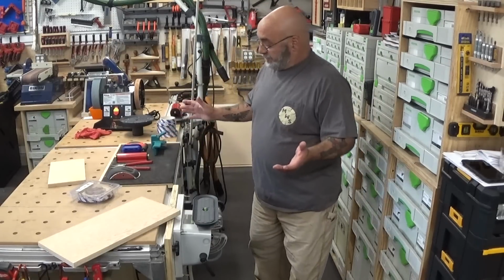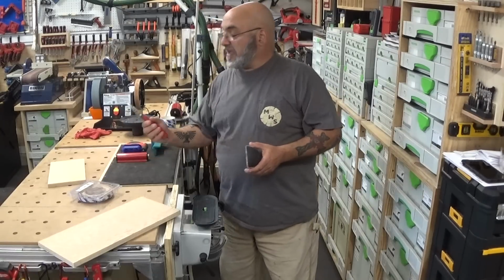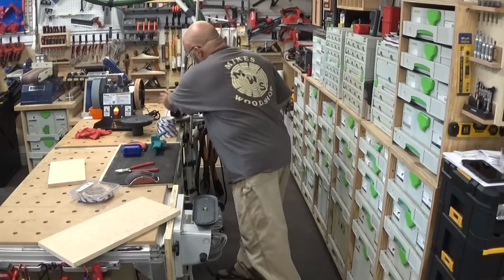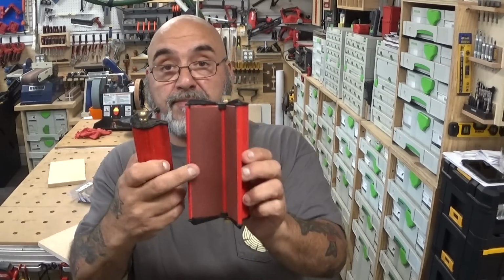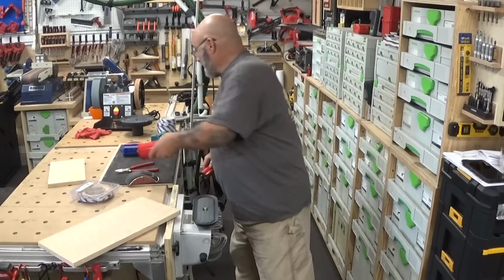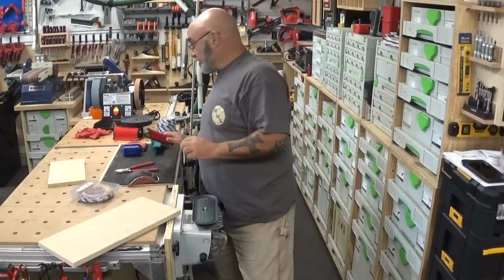Alright, as far as with the pieces, I use this Festool sanding block, and I keep 80 grit sandpaper on it. Then they have the edge clipper, which I actually use just to cut the tape. They have the fast break in the small size, and then they have the fast break in the larger size. Sandpaper is all replaceable. On both, they sell pre-cut pieces. I'll add all of the descriptions, the model numbers in the descriptions below. So for most of the wood that I use, which is 3/4 to 1/2 inch, this thing stays, and I'll show you where I store all this. I store it all in one little secret compartment.